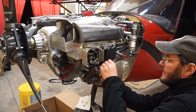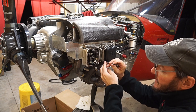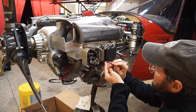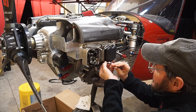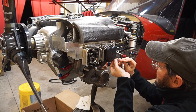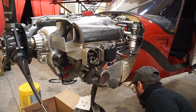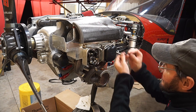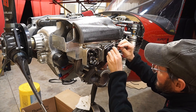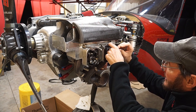UL Power uses a mechanical flat tappet cam — it's what's been used in the racing industry for years, and they use it today. They're building brand new engines with this same valve setup today, and even though it's been around for decades, they're using it because it works, and it works really well. A lot of the engines that see heavy percent power usage today are using push rod engines with these mechanical valve setups — mechanical cam, mechanical lifters and all that.